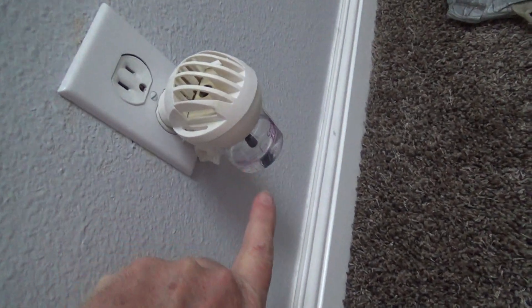All those different things come into play when you're installing an electrical outlet like this. Here's one more thing to know about this. See those little grooves right there — there's a slight groove indentation right there. Here's another one right there. You look on these tabs — one there, one there. Well, I could take those off. I can take a pair of pliers, bend it back and forth and pull those off. The only reason why you're going to do that is if you put this in a cut-in box.